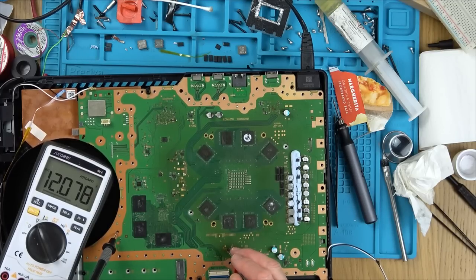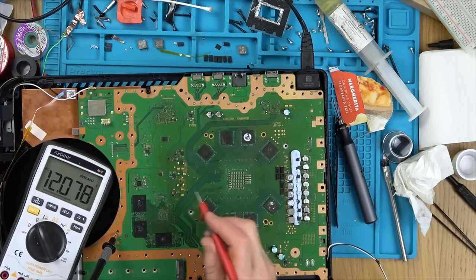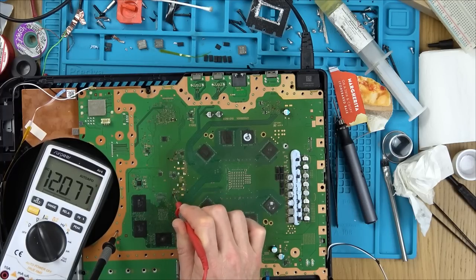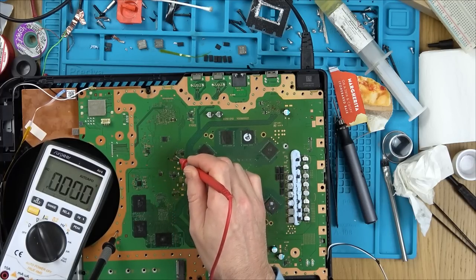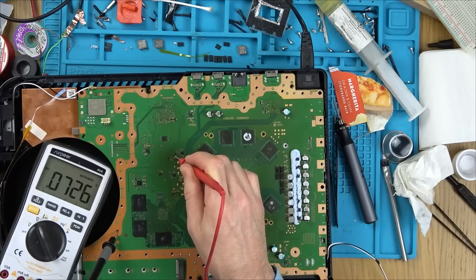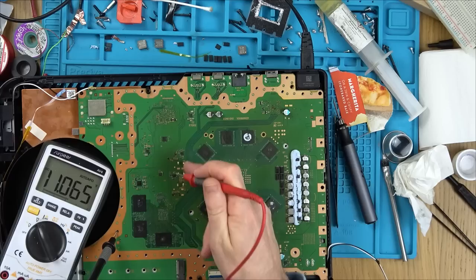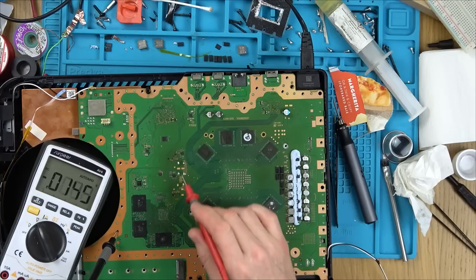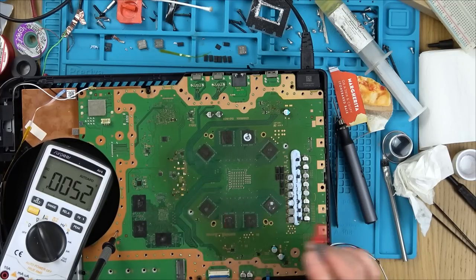So the 12 volts is feeding this power rail, but yet there's nothing coming out of it because of the short. Likewise with here, this is where the burnt MOSFET was, 12 volts here and also 12 volts up here. No, this one. There, 12 volts. But it's not going through to feed these ones because I've removed the caps and coil now, but still there's a short going forward, so that's why it can't generate.